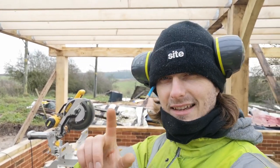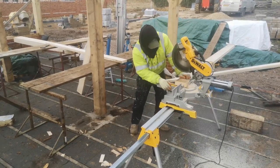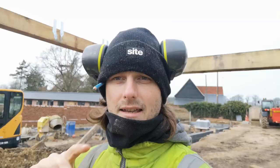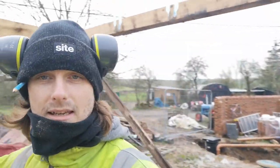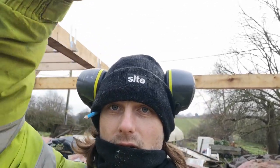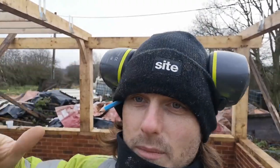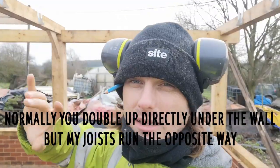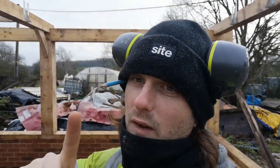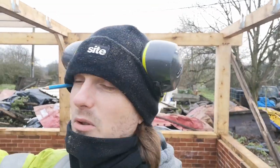The plan is to double each joist as it goes across, because in the middle I'm going to have a stud wall — there's a shower room just on the end. I'm just strengthening up the walls: if you don't double up the joist below the stud wall it will sag, crack your plaster, and all that. The structural engineer didn't say anything about this — the first structural engineer didn't know I was putting a stud wall across. I don't want building control to pull me up either, so I'm going to double each one once the hangers are in — it'll just be more solid that way.